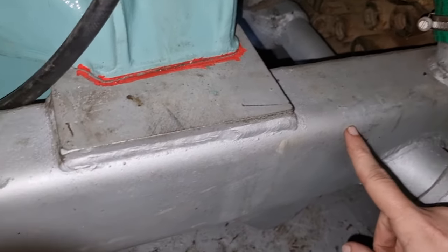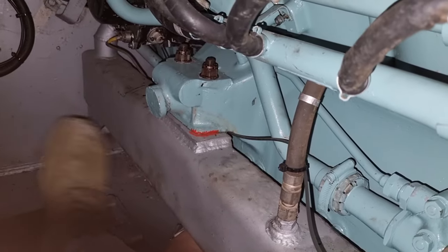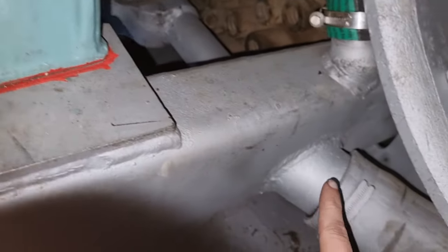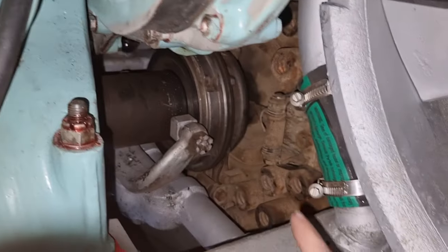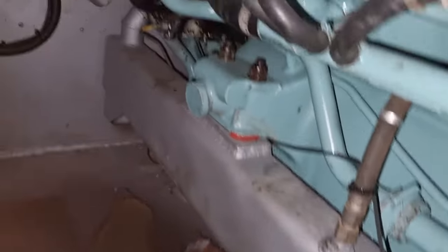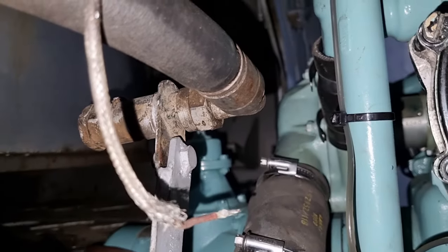While we are here, we'll have a look at this bar here. It is the mounting for the primary engine, but it is also the water rail — this is hollow. Water actually runs all the way through these. This pipe goes under and it goes up into the radiators. It also plumbs up here into our header tank. The water pump is on the front of the main engine, just around here — that's the off-coloured one. That's the main water pump.